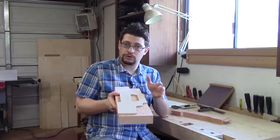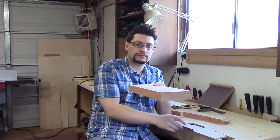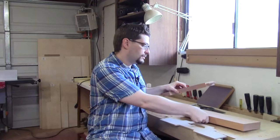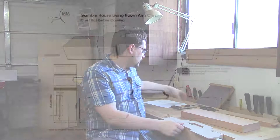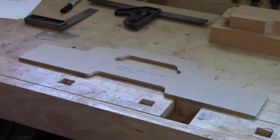It's going to be too long for the chair and we're okay with that. After we've created the shape and cut our mortises, we're going to cut it to length with the angles that match the top of the leg in our chair — we'll pull those angles directly off the chair. I also have our rear apron here and we're going to mark it out for mortises as well. I have my template for the crest rail and two printouts from the plan showing the mortise locations — one for the crest rail and one for the apron.